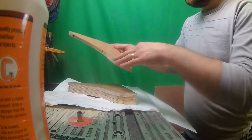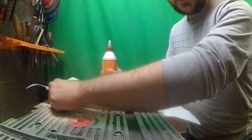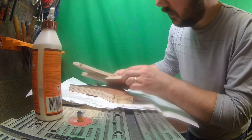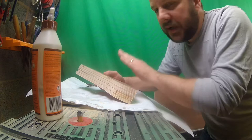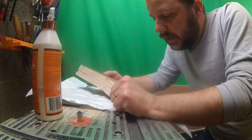What I am going to do is mix a bit of the leftover sawdust and some glue, just to fill in the small holes and voids in the plywood. I'll get those filled in and we can sand them up. Probably going to paint them either black or white — not quite sure yet. Then we can make pocket holes and screw them all together.